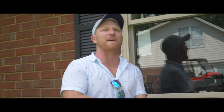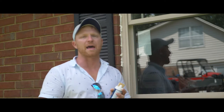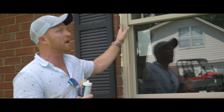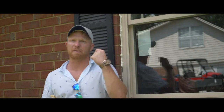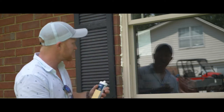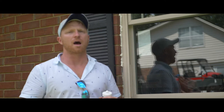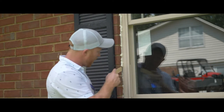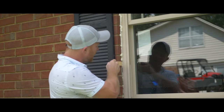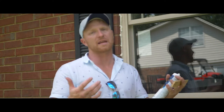A lot of people foam it and then try to mess with it while it's still wet — don't do that. Let it dry, especially in these summer months in south Georgia; it won't take long. If it gets on something you don't want it on, let it dry and you can peel it right off. Once dried, don't cut it out or pull it out — you'll lose efficiency. Just find a small tool and poke it in just beyond flush so you can get your caulking over it nicely.